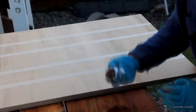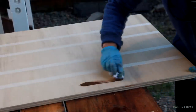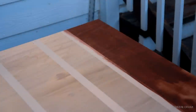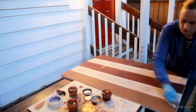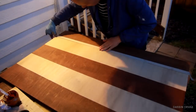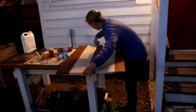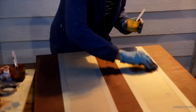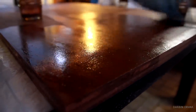Each board I'm staining using a slightly different colored stain. I start with the 3 middle boards, pull off the tape, put down some new tape, reapply some stain to stain the middle 2 boards, and then I let it dry. I continue to work with a darker stain in the periphery around the whole table to give the surface a more lived-in, realistic look.